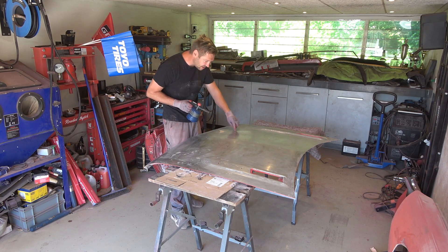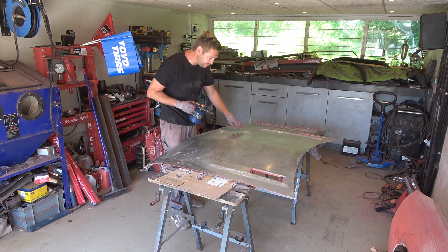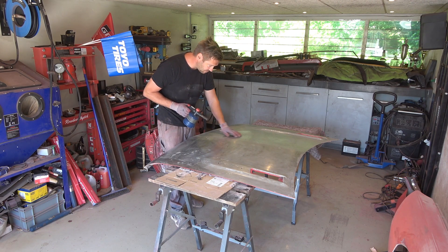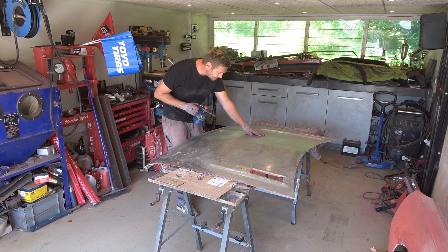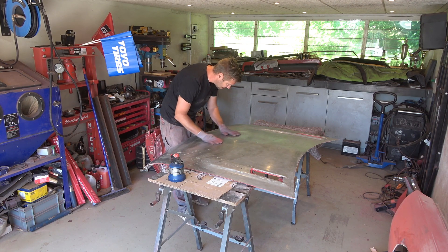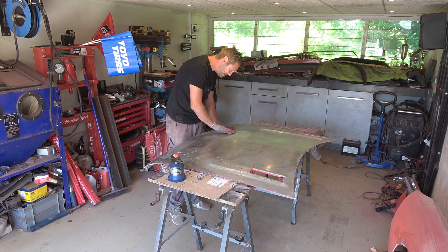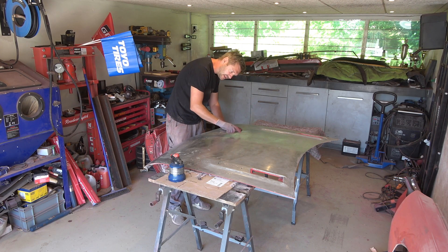You can actually see where one of the old glue lines were underneath — it runs right here, because they just glued or filled in the entire frame. It still let go though, so it didn't work. That is what you get — a really uneven hood. Already just applying a little heat, you see this now doesn't flex. We need a little more here — I think we are going to apply it to the area around it. But this just gives the hood back its shape, except for this spot where the old frame underneath was glued and has been pulling on that because of the indentation that was there. So we will have this fold, and that is something we need to address.